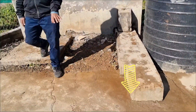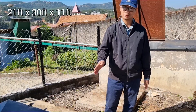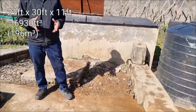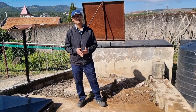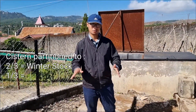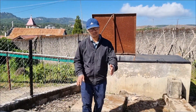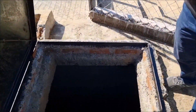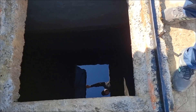The storage tank, or cistern, has dimensions of around 21 feet by 30 feet with a depth of 11 feet, giving a volume of around 196 cubic meters or 1 lakh 96 thousand liters of water — just short of 2 lakh liters, which is sufficient for the house. The tank has been divided into two parts: two-thirds is meant for winter and one-third is for summer. The winter stock is full even though it's December — the water is just a little short of full, and enough for the winter months.